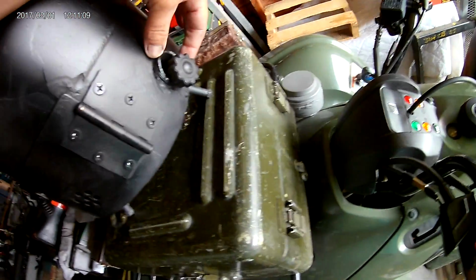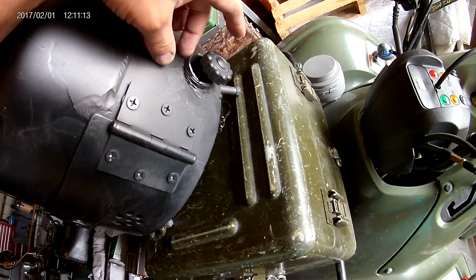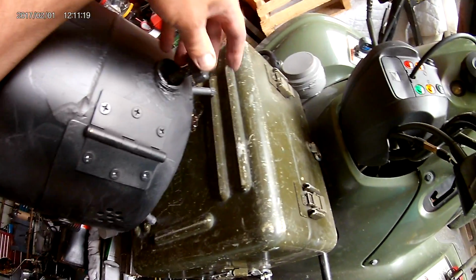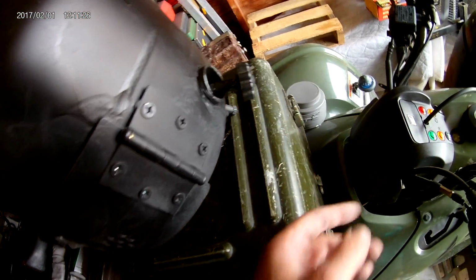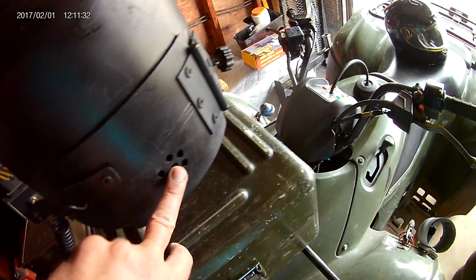And I just use black pipe that I cut off with the thread end. And take your time cutting these holes. You want it to be pretty close. And then I've just threaded it in. And another stem, an old valve, and another washer for the underfire control. And this door is a little different, so I have an additional air valve here, as well as the underfire control. The door is all the same as the previous stove.